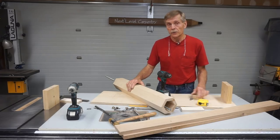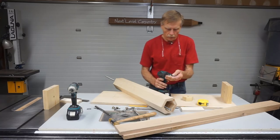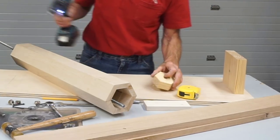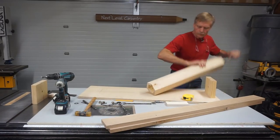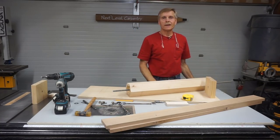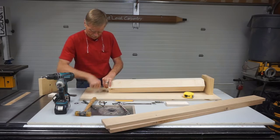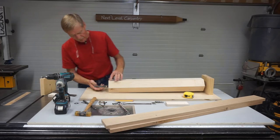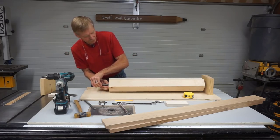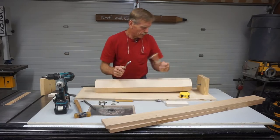As an entry into the You Learn Something New Every Day journal, I'm having trouble getting that rod to slide through that hole. I'm taking a small countersink bit and I'll increase the target size a little bit. That did it. It spins on there pretty well after using the thread chaser file on that rod. Snugging that down.